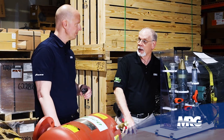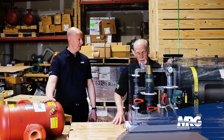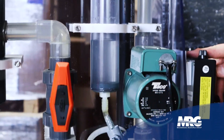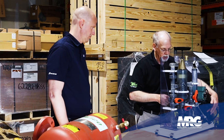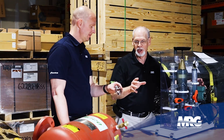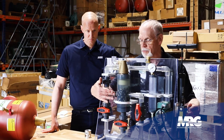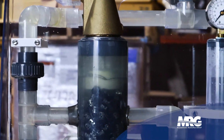We've got a demonstrator that we'll show. What we have here is a miniature replica of the air and dirt separator. On top is the air relief and we have a drain at the bottom. We have our pump — we'll be pumping through, coming up the top, going down through the air and dirt separator, then coming back to make a circle. Inside this separator we have a miniature pall ring — each one has different sizes based on volume and flow rate. We've got some sediment in the bottom, and this pipe is going to be clean because it's going to trap all that dirt.